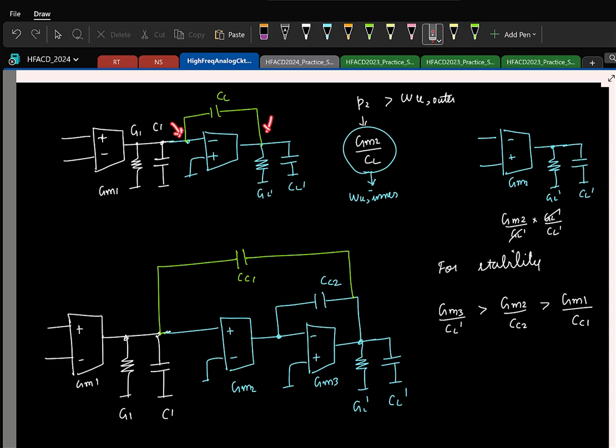I just want an overall inversion from input to output. From here to here, is there an inversion? This is not positive — because this is positive, but this is giving negative gain. Always note that the capacitor CC must be in negative feedback. So this has to be negative. GM3 will be only a common source. Both of these can be common source, since it takes one input and one output. Here it is a plus sign, so you have to be careful — you may need to put one more stage. At a block level, it is like this.